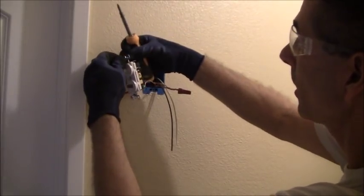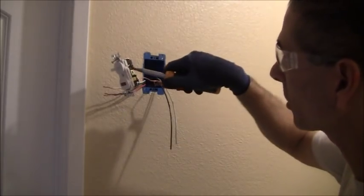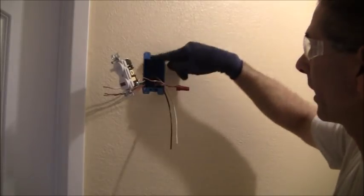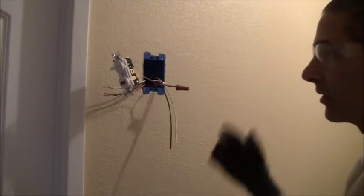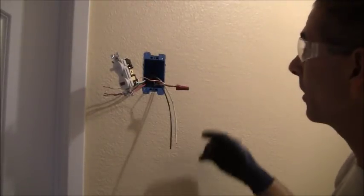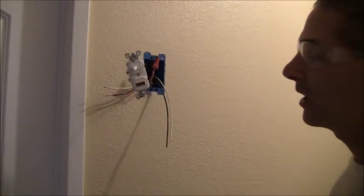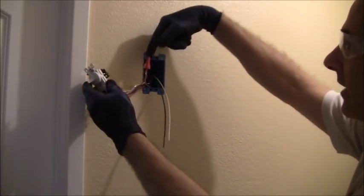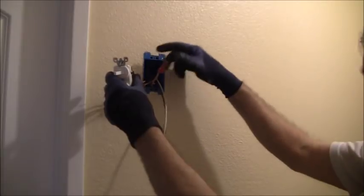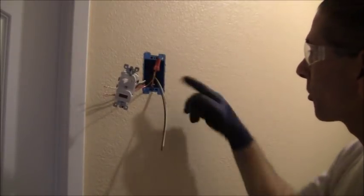That's everything for the white, black, and red wire. The red traveler just hooks straight onto the traveler terminal. When I tuck my wires into the box, I always try to have my wire nuts facing up rather than down. Hypothetically, if there was ever any water in there, I'd rather have it hit the wire nut and run down through the box bottom, rather than collecting inside an upside-down wire nut. So I always put my wire nuts up like a little rain shield.